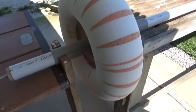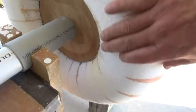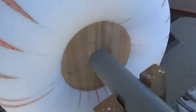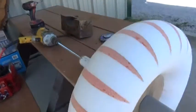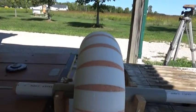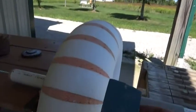All right, here we go. We've got it finished and sanded. If you look in here, it's nice and smooth in there. This is what we're after — a smooth contour. And this can go for any size toroid, as long as you can foam it up on a disc plate like this and smooth it up. Here's a look at the profile of it. As you can see, it's real nice and curved, with no ridges or bumps. And you can do this with 60-grit sandpaper, which is what I used.